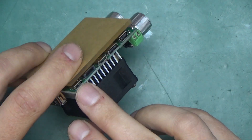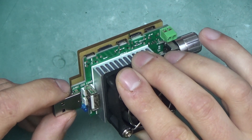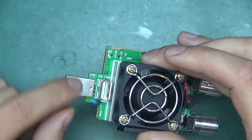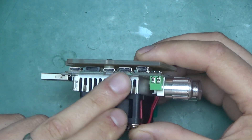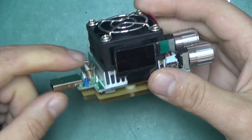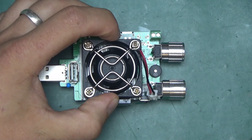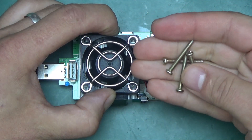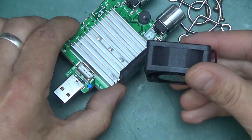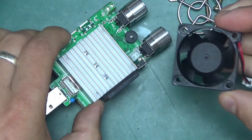This USB is marked as SIS power — by plugging something into this we can power up the device. That could be handy when dealing with a power bank that requires a minimal current draw, otherwise it shuts off. I have a little JST connector for the fan so we can get that disconnected. The screws are long screws into the heatsink, right between the fins. I have to be careful here because the display is stuck with double-sided tape onto the heatsink and the fan is on the side of it — don't want to re-solder this.